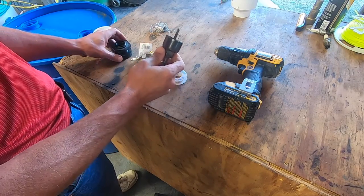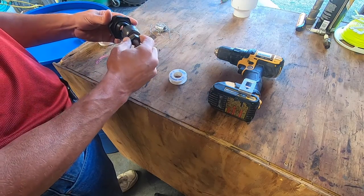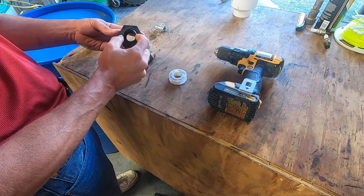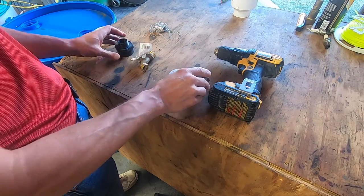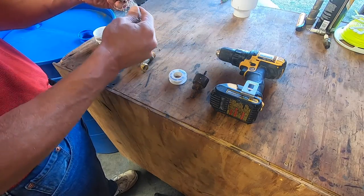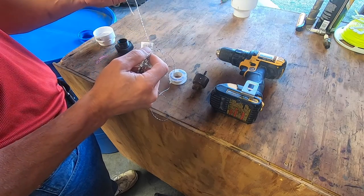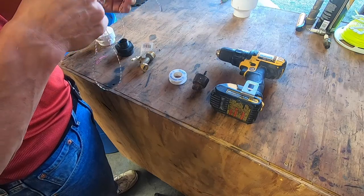You're going to need a hole saw. Whatever fitting you get, you need to make sure it's the right diameter — you don't want to go too big or too small, so make sure you have the right size hole saw and a drill. One other thing you're going to need is some string, just some light string — I use kite string. And this is the trick on how you get the fitting in. You'll need some type of nut or something heavy to tie onto the string.